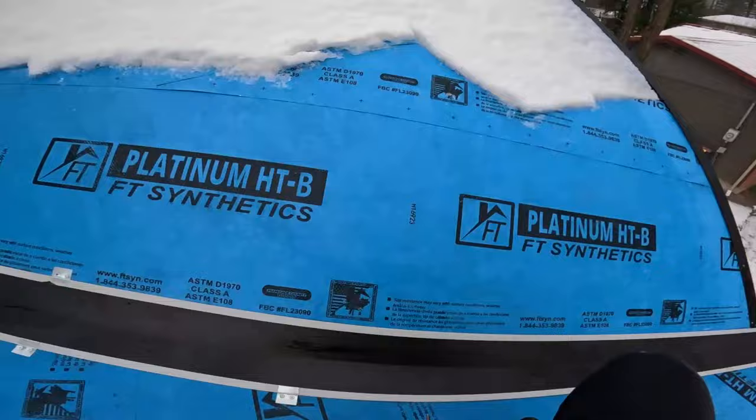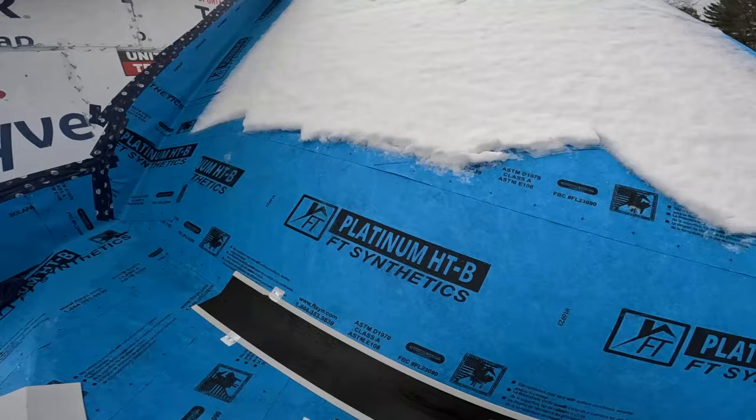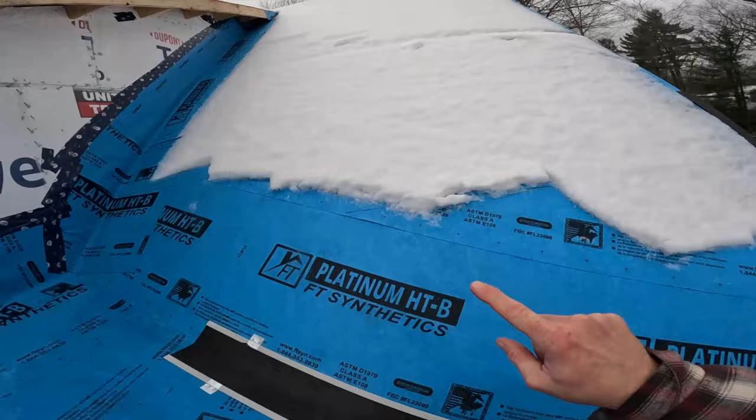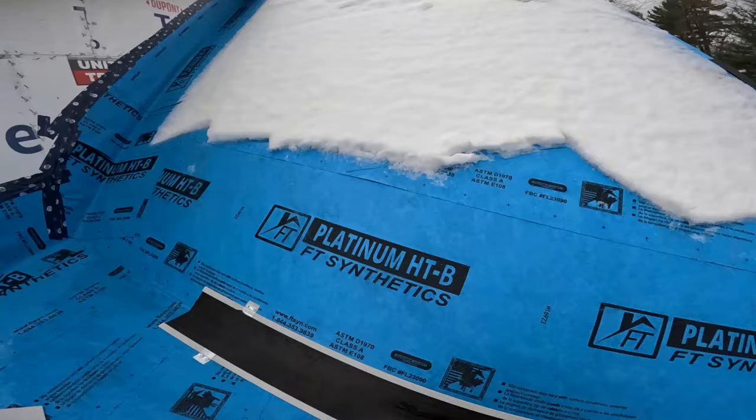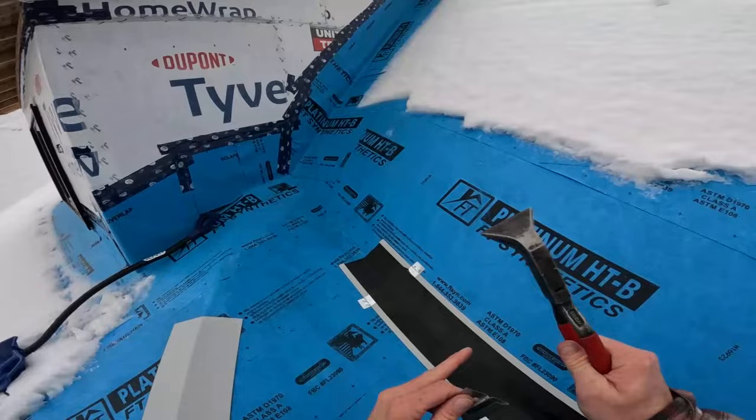And how you read the chart is, okay, well, that's a 10-12 roof. The roof I'm sitting on is a 4-12. And it's like Battleship, right? You go 4-12 over, 10-12 down, and right there the chart tells you the angle of your valley or your hip. So this hip, for example, would be a 4-12 going into a 4-12. So you would look at the 4-12 hip and boom, you have your hip angle.